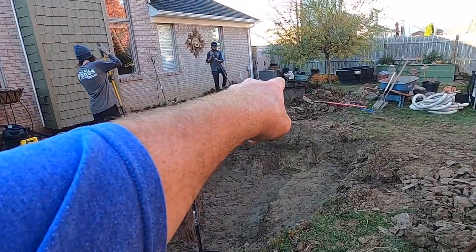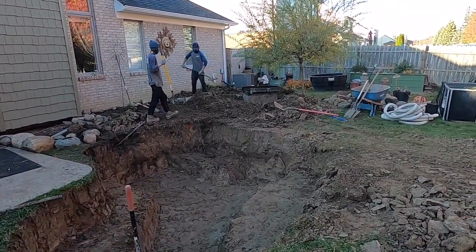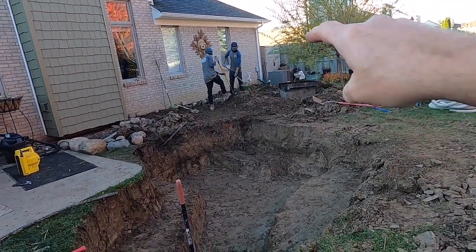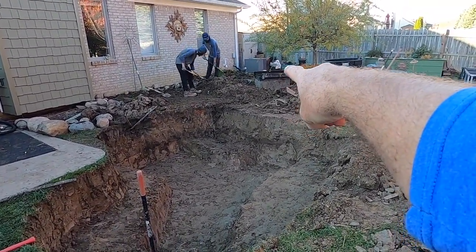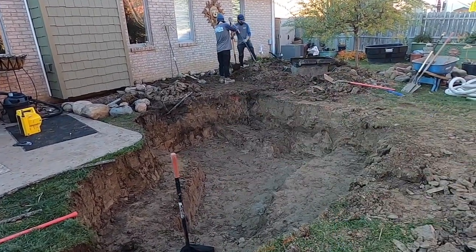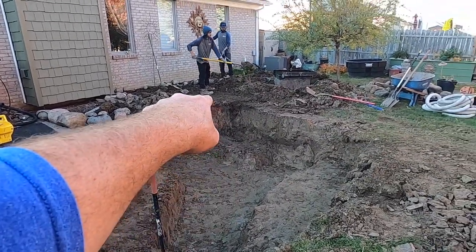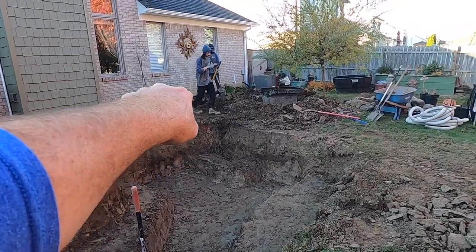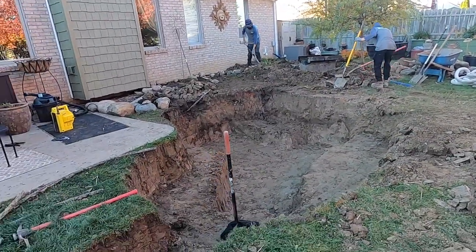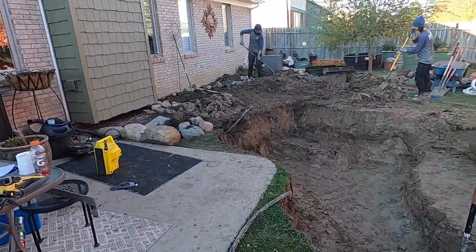We have the waterfall. Derek's working on the waterfall. We've got the old classic style biofalls from way back when. They have a drop coming out of there. It's gonna go really wide, and then it's gonna drop there. That little orange mark right here, that's our water level. So we're gonna have approximately 6-inch drops each time. So they're all gonna be at different angles, so that way the viewing area doesn't look like it comes straight at you.